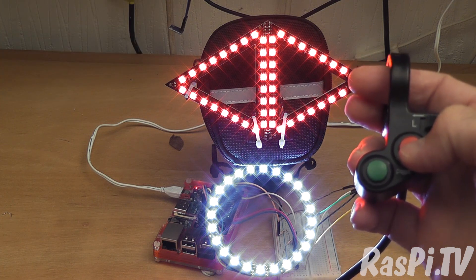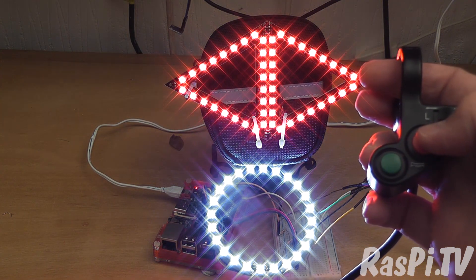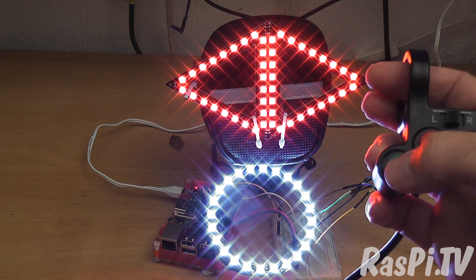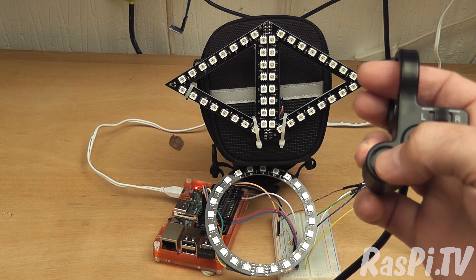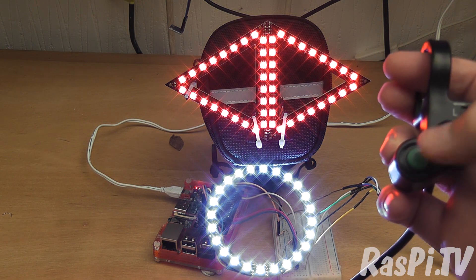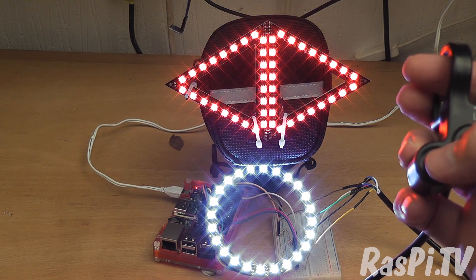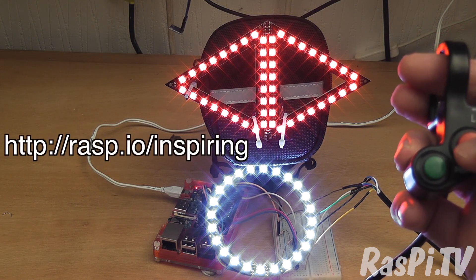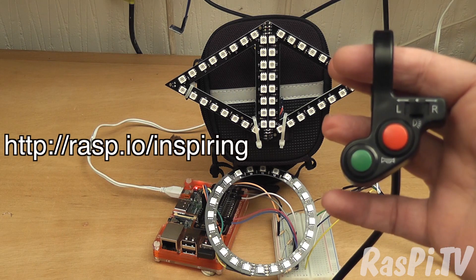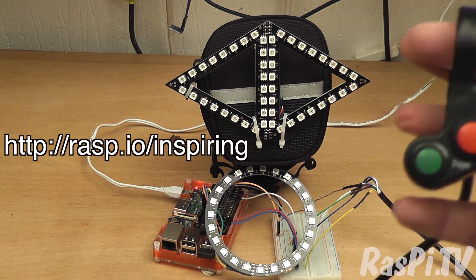You've got one here for full headlights and brake lights — that's a latching switch. And you've got another one here for off. If you hold it a medium length of time, it puts the tail lights on. And if you hold it for about three seconds, it will shut down the Pi. So that's really, really useful. And that works — I got that working on day three as well.